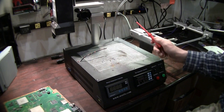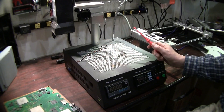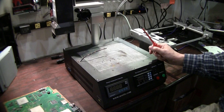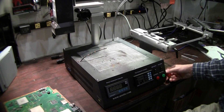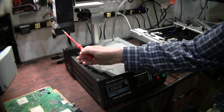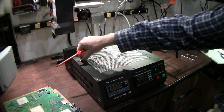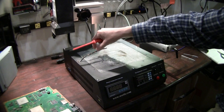And that's a big thing on this unit — this back fan really doesn't pull much air and it doesn't seem to draw much air across the plates, because it's running when it's on. So it's pretty much just pulling some air across the bottom, but all these parts up in here take a lot of heat abuse. Even under normal use, if you did a lot of reballs this unit would probably get pretty beat up. So again, not a great unit for large boards because you're going to be running a lot more heat on large boards. We took the probe from here, routed it — it had enough slack — pulled it across, drilled a hole, brought it out, and wrapped it in a copper strand of solid core heavy duty wire to make it adjustable.